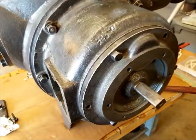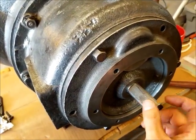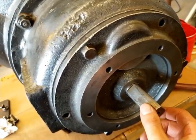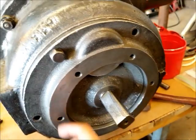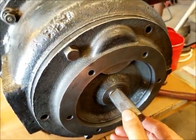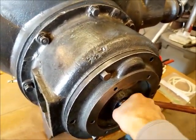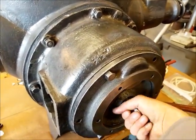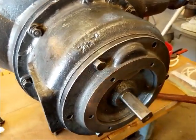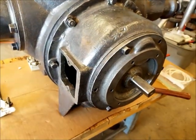The second attempt I got it a little bit too short so it didn't quite meet at the top nicely. Third time I got it on there and I'm pretty happy. I have three bolts in so that plate is tight and located where it should be. I can still move that shaft freely — it's got a little bit of drag on the seal so I know it should be sealing up well, but it's not binding in any way.